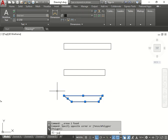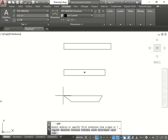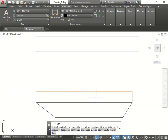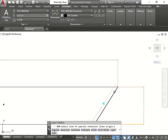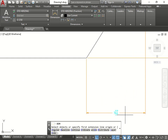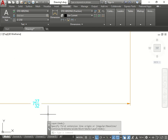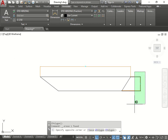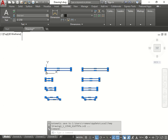Join it together and there we go - that piece is connected as well. Checking dimensions: this should be 39 and a quarter - it is. This should be 5 and a half - correct. The distance here to here should be 3 27/32 - correct. And 7 27/32 is also correct. All pieces are done, joined correctly.